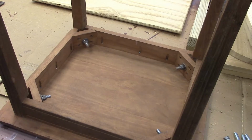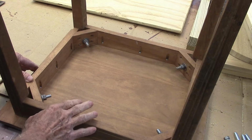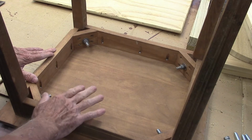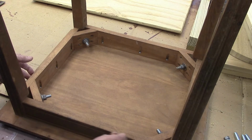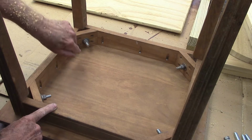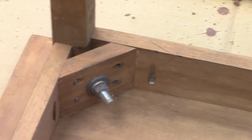The table jig we're going to make supports making this standard arrangement here. There's 1,000 ways to make tables, but this is probably the most common, with the corner blocks, the side frames, and the legs bolted into the corner blocks. By using the table jig, you get this real precise, professional outcome.